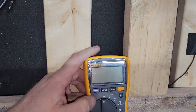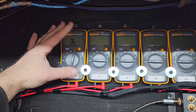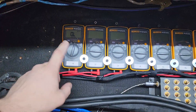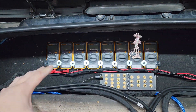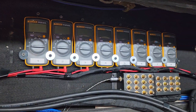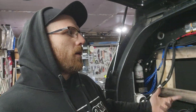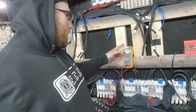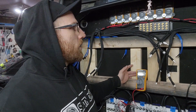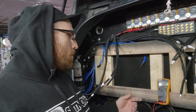We got the big Fluke 115 — this one's pretty nice, a lot more expensive than these basic ones. These do have an automatic shutoff, so if you forget to turn them off they will eventually shut off and you just come back and shut it off. Honestly I really like doing this. You do have some money in meters but you don't have to buy Fluke — you could literally go to Harbor Freight, Walmart, any type of digital multimeter. I'm using the most basic functions on them. These do have a hold function so I can hold each one to see what the max or minimum was on the AC voltage, which is pretty nice.